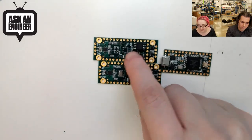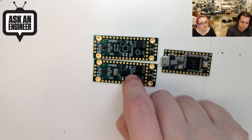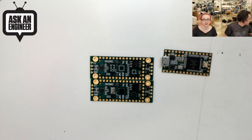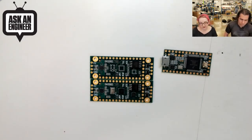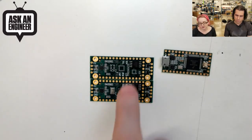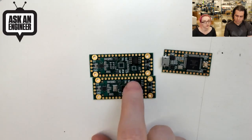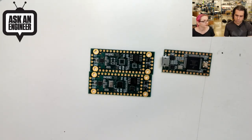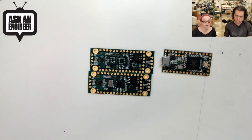This uses a chipset from NXP Freescale — I didn't even know that Freescale made accelerometers, magnetometers, or gyroscopes, but apparently they do. They also wrote and released sensor fusion code that apparently does a pretty good job of orientation. These are fairly inexpensive chips, only about $3 altogether. So it's a very good alternative to the BNO055, which has built-in fusion. This one you run the code on the chip, but there's code available for both 8-bit and 32-bit processors.